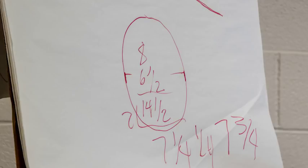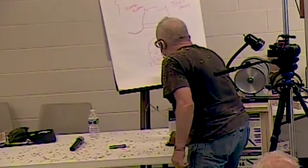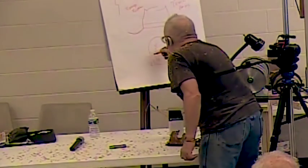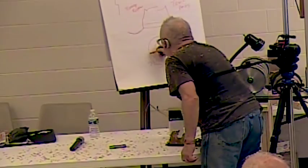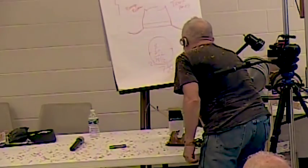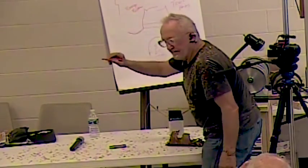That typically is half size. But to get that, we've got to add a half inch, because we're going to put the calipers on the outside, and we're going to have an eighth inch on the band. We'll have an eighth inch of thickness here and an eighth inch of thickness here. That accounts for a quarter. We have to add that quarter, and then we have shrinkage.